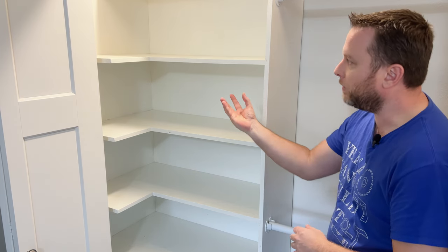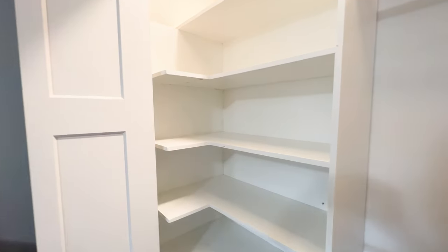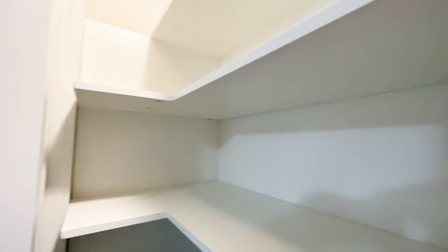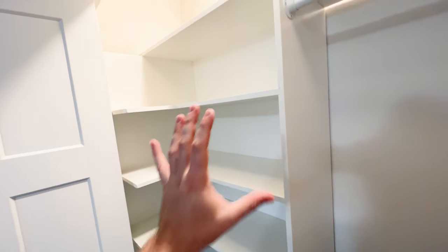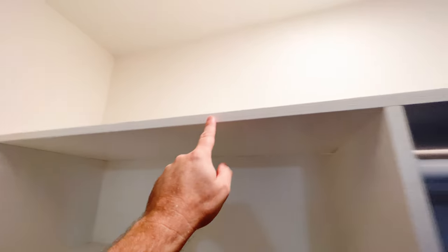Let me show you underneath and how these are attached — they're kind of just floating here but they are very strong, because my son actually climbed on them. Looking underneath, you can see the pocket holes right here. This is wedged up against the wall and is two feet deep, which is how deep my closet is. The whole piece was installed in a section — twisted in and then set. I put a backing on it to hold everything stable, found the stud, and screwed it into the wall. Then I attached a top board that spans all the way across.